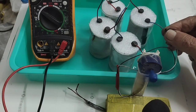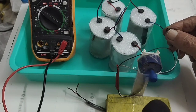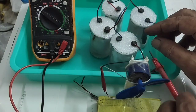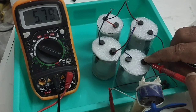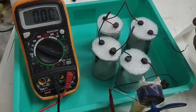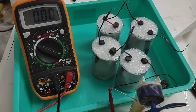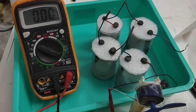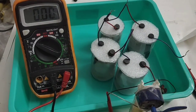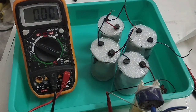Friends, if you like this, kindly press the like button. You can post your comments. Please subscribe. In front of you, I have done this — this is called a super-capacitor. After running, it is now 5.8 volts. If you start cycle charging, it will go more than 7 to 8 volts and the amperes will also improve, because this is just the initial saturation with the zinc chloride. It is a very good super-capacitor. Only carbon, zinc chloride, and filters — that is all. Thank you. Please subscribe. Bye.